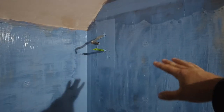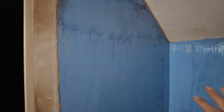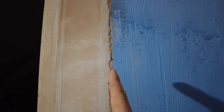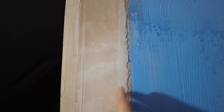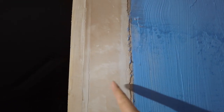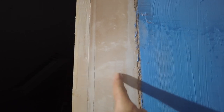A couple of tips: you're supposed to be getting this on quite thick, so when you load up your brush just have a quick look to see if there are any lumps that you've basically dropped somewhere, because that will be a nightmare when you come to tile as it all sticks. Also make sure you keep about 10 to 20mm back from where your tiles are going to finish — because if you go further out, this blue stuff is horrible to paint. So that's me for today.